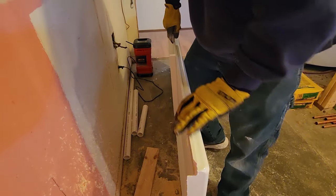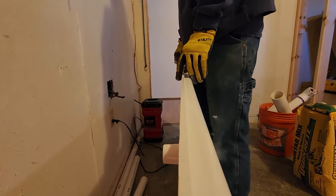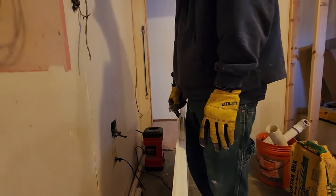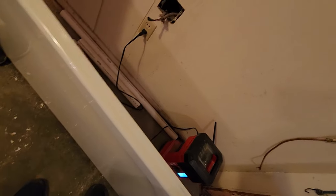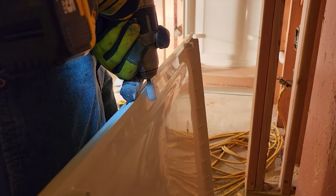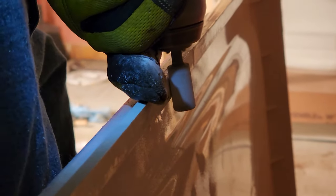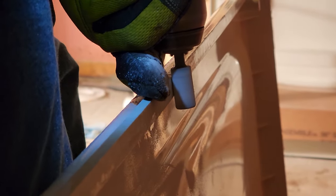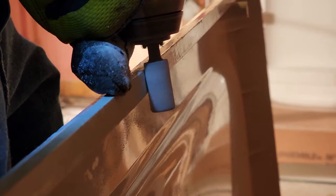What we've noticed about these shower units is that sometimes they show up with damage — they're cracked already. A lot of that's just shipping; they come in cardboard boxes. We check them in ahead of time. On these, Mike is actually using a file on his cordless drill to shave the walls down a little bit. You want everything smooth. Sometimes you'll pull these right out of the box and everything slides together perfectly, but not always.